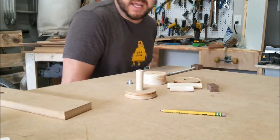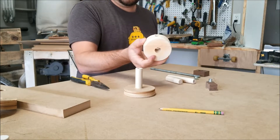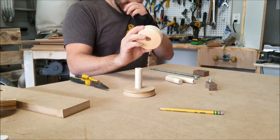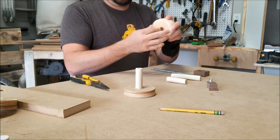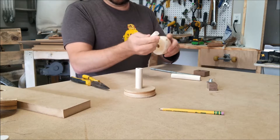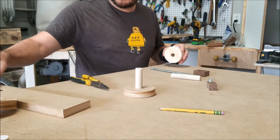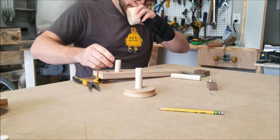Today we are going to be making a bench dog. The material we're going to use here is a t-nut. This is a circle that we cut from the table build — a three-inch circle — and I drilled a three-quarter inch hole to allow the three-quarter inch dowel to go inside of it. Then I did the sanding, same thing we did on the other bench dogs, so that it will go into a three-quarter inch hole fairly easy and snug.